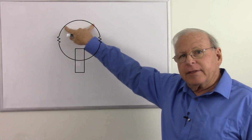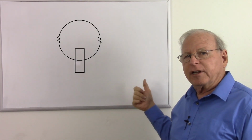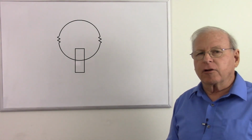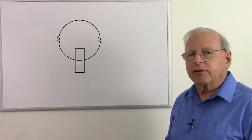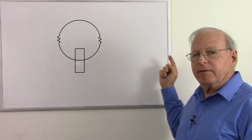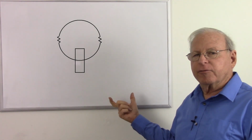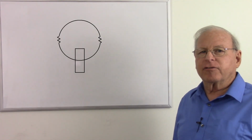He assumed that there was EMF out here, but he didn't measure any. He assumed that the voltage that he did measure at the bottom was illegitimate, and therefore concluded that Kirchhoff's voltage law was incorrect in this case. However, if we understand how the toroidal inductor is working, we can see that we don't expect any voltage out here, and we expect all of it over here. And his illegitimate measurement is actually quite legitimate, and this just simply acts like any other series circuit.